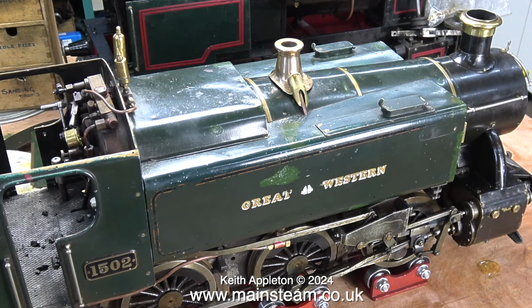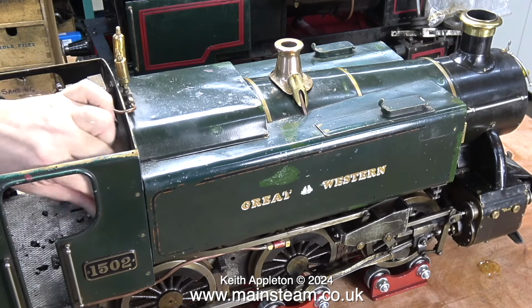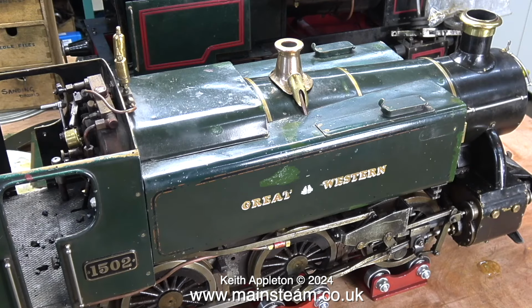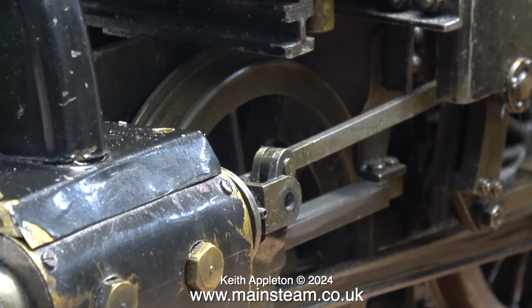In this video I show a very common problem. Just one word: rust. I connected some low pressure compressed air to the engine. It tries to work, but it can't work. The question is, is this a piston valve problem where one of the rings on the bobbin has broken up and gone down the port? Or am I looking for too complicated a problem? Is it something simpler? There's only one way to find out.